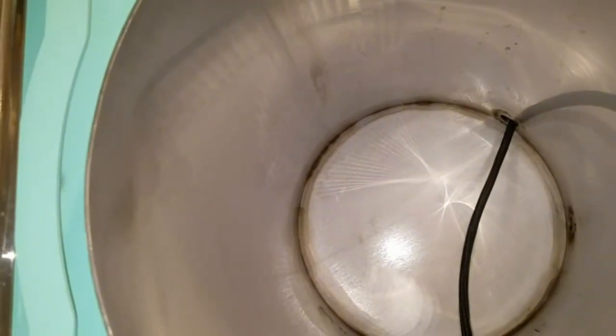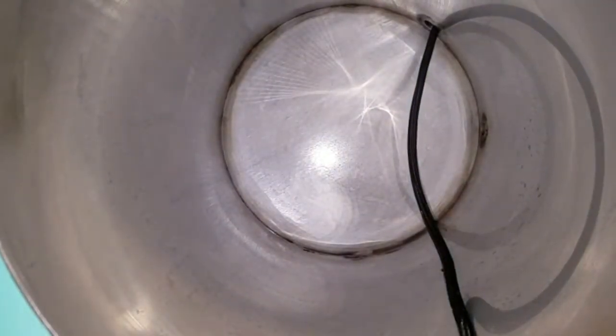So we're going to get this thing all cleaned up with the vinegar and the water. Let me just wipe this out off camera, and I'll be right back. All right, so it's all clean in there. All vinegar clean. Like I said, these welds are terrible. Looks like they punched through the whole floor a couple times, but I guess not. But it holds a vacuum down to about 15 microns, so it's pretty good. That's the tested. I didn't continue beyond that, but still.